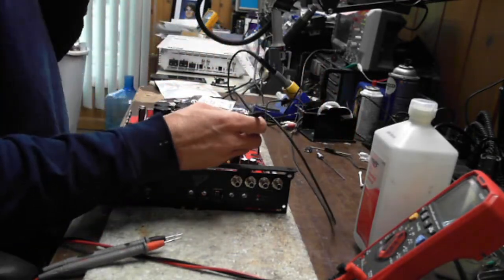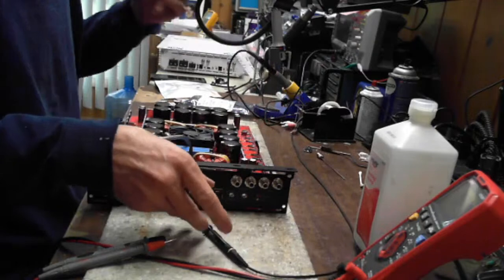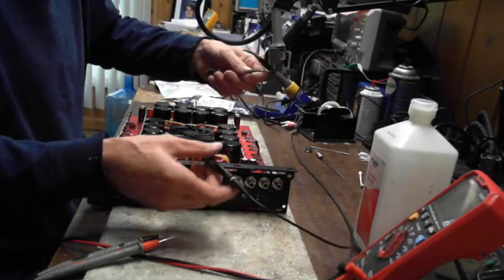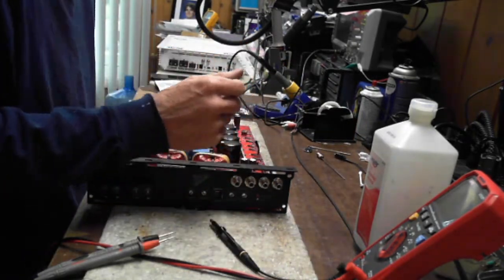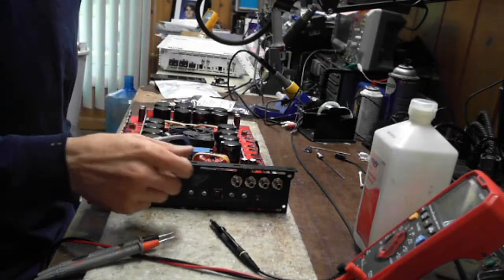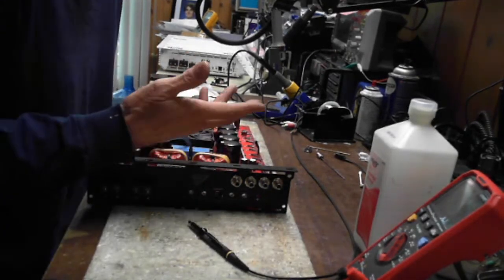And if your scope is isolated from your power supply, you can probe around without having any worries about causing a ground loop, which can be real drastic if you're working on DC voltages that are tremendously high. But you can have your ground clip clipped to the reference point of what you're trying to measure, I should say. Now, if I were to fire up my 50 amp regulated power supply over there that is not floating, it's not isolated, it's bonded, and I hook up my ground probe to the amplifier and then probe with my probe, well, it shorts the rail to earth ground.